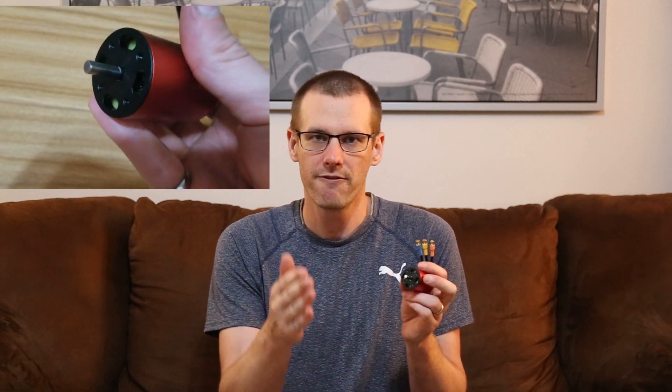On the second motor example, the manufacturer has provided an extra bit of safety — a barrier between the fastener you're going to drive into this motor and the copper windings inside. If you look carefully, you can find a plate that resides right in front of the copper windings. There is a gap between that barrier plate and the front plate of the brushless motor, giving extra room to drive the fastener in safely, as long as you don't crush through this barrier piece.